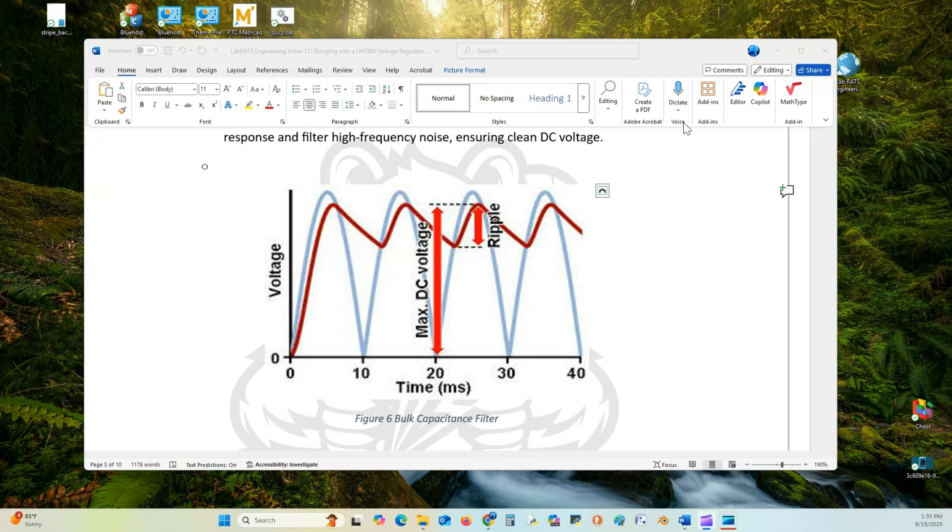The third part of the power supply is the bulk capacitance, appearing right after the full wave bridge rectifier. The light blue line represents the positive peak of the sinusoidal input at half the peak-to-peak voltage. As the signal filters through the capacitor, charging and discharging, the time constant is much larger than the 120 Hz ripple wavelength — 120 Hz because the input is 60 cycles doubled. So you have a small 120 Hz ripple, which matches the 120 Hz ripple rejection noted in the electrical characteristics.